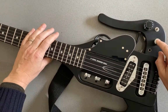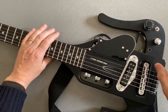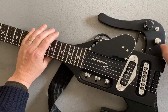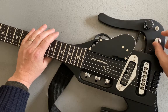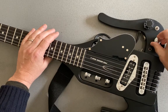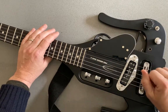Some of you may wonder why I didn't add a tone control underneath the piezo the same way I did the humbucker. The reason is passive piezos hate tone controls — it's just not going to work very well because piezos are not suited for that kind of circuit. The piezo volume actually isn't bad — the volume over here with that linear pot was terrible, but the piezo volume isn't bad. It has a bit of a tone effect in it: when you turn down just a bit, you'll lose some of the highs from the piezo that are annoying. A passive volume on a piezo isn't terrible, but putting a tone on it would be a waste — it just wouldn't work well. So I can balance things out just using these three controls pretty effectively.